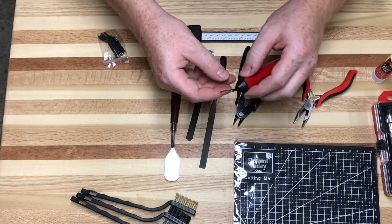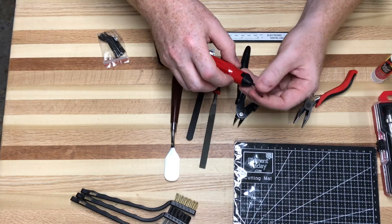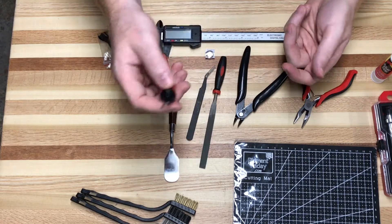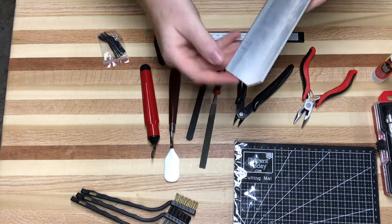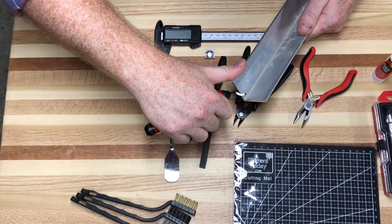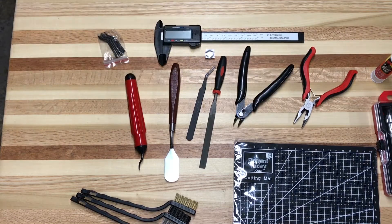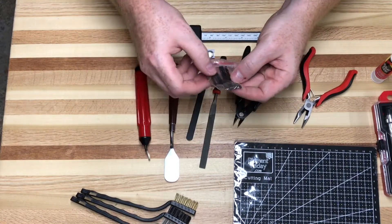The other one — most people don't know what this is — it's a deburring tool. It comes with a sharpish hook tool on the end that swivels. The idea is you can take any 3D printed part, or even a metal part, and drag it along the corner to deburr the edge. For example, this is a piece of aluminum I've cut — the edge is relatively sharp — and you just pull the hair off so it rounds the edge over. It also comes with a whole bunch of extra heads because they do wear out and get dull over time.